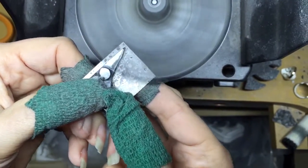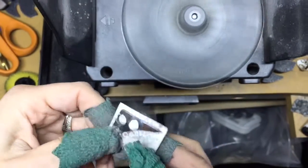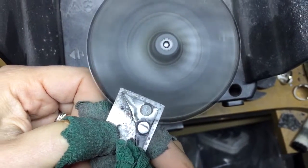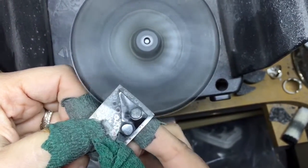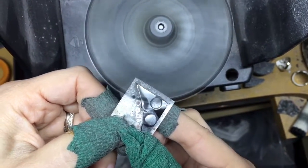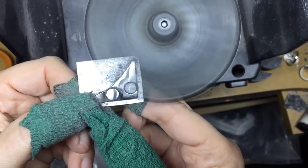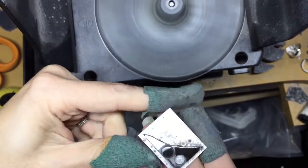What grit is it? It's a 3S Fine Unitized Material by 3M. This will blend the metal instead of grinding it off like sandpaper, so it's very forgiving. I love it — there's a really neat piece. Just to give you an idea, I'm going to let you get all the deep scratches off. Can you see how it just blends it, without grinding any kind of material? We'll just blend that corner a little bit — and that's how you do it, clean that up pretty much.